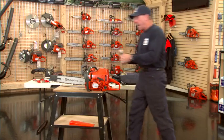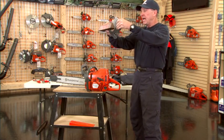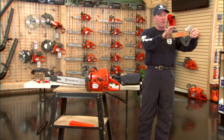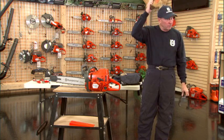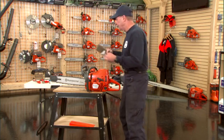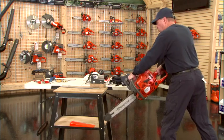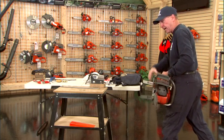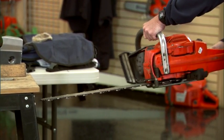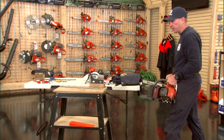What's happening is as the saw comes around the top corner, you can see how much of a bite goes into the chain. It stops the saw from running, and in turn — as Newton figured out when he got beamed by an apple — for every action of energy there's an opposite and equal reaction. It's going to throw that saw in the radius of the plane that you're holding it. Touching the top corner here is going to create a mechanical activation. However, if you're in a felling position, that saw would stop and go — winging out somewhere around where you don't want it to be.